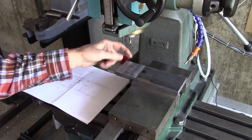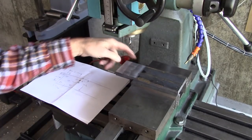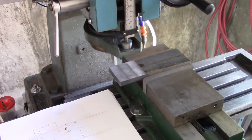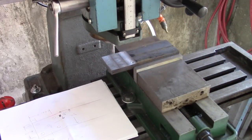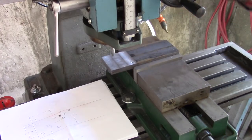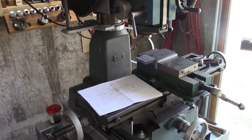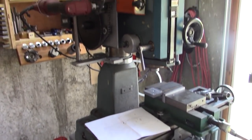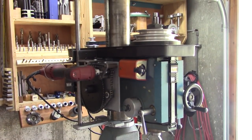Let's go take a look on the mill. I'm going to drill that hole pattern in here. I've milled the end of it and located it at these two sides on my DRO, and there's a pattern I've got to drill. Now I've got to raise the mill head and put a drill chuck in there — and here's where my round column mill fix comes in.